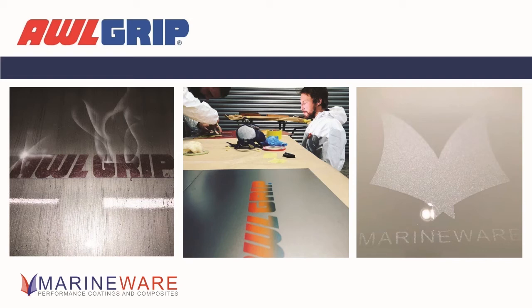If you took a conventional topside and wanted to spray it white and then apply a boot line in dark blue, you'd be looking at three or four days with drying times. The beauty of SE is that — depending on film thickness and temperatures, but at 23°C — we have a tape time of about one hour. That means you can apply multiple colours in one day and then clear coat over the top, putting the whole white hull and blue boot line into one paint shoot.